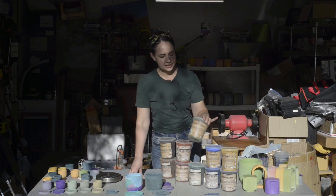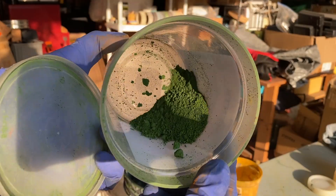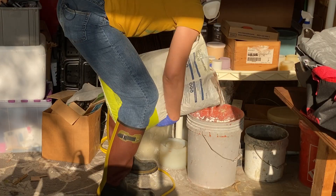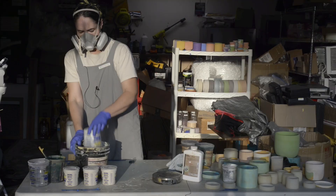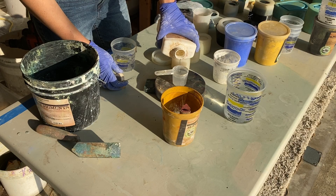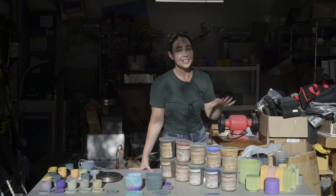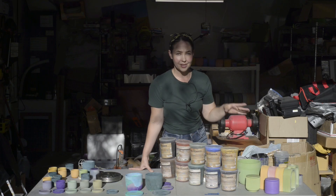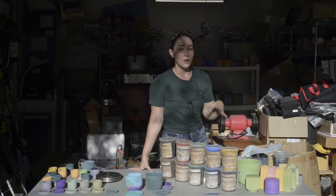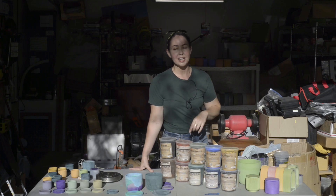To start off, we're going to make one of my best-selling colors: green. I'm using the Buddy Rhodes green oxide pigment with my homemade concrete mix using white Portland cement, and I'm using a three-to-one ratio of three parts sand, two parts cement, one part water, with 1.2% Buddy Rhodes water reducer 555 liquid. Now, white Portland cement is a specialty product, so it might be a little bit difficult to find at your local hardware store compared to gray. If gray is all you have, you're more than welcome to use that. However, if you are looking for smaller quantities, you can always find it on Amazon and I will link that down below.